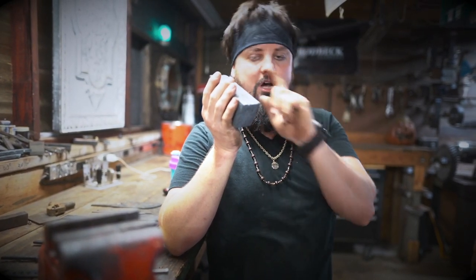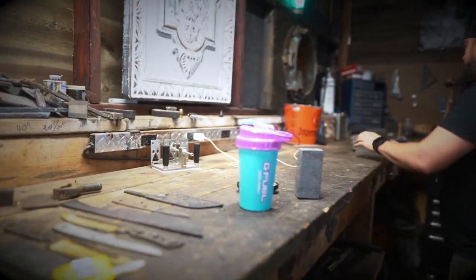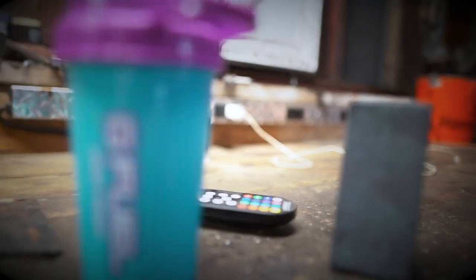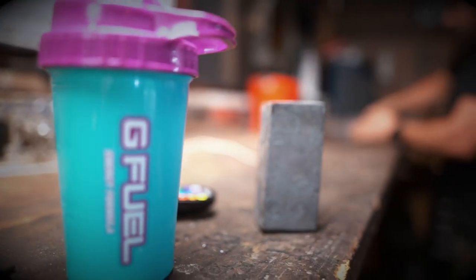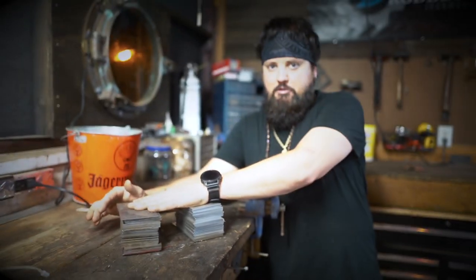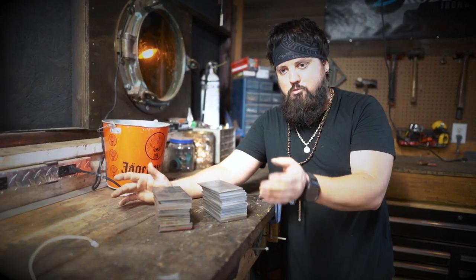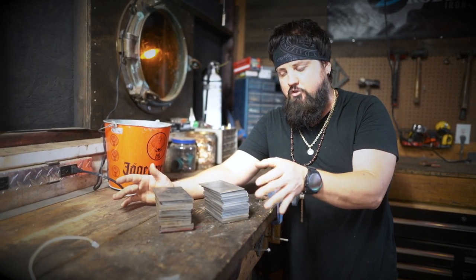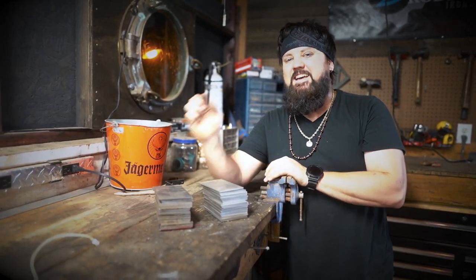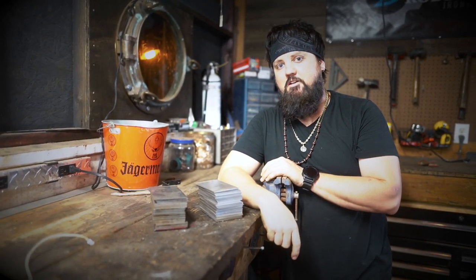I'll show you some clips of how I forged this twist Damascus out. I've got it set aside — once we get to the point where we need to make the butt cap and the top of the axe I'll come back to this piece of twist. For now, we're starting with all this 1084 and 15N20 cut up right here. We're going to alternate the stacks to start this axe build. I'll have to make two billets because it's already going to be huge, and then after forging, surface grinding, and restacking, I'll integrate different sizes of 1084 and 15N20 to give some really cool contrast. That's the plan — let's go check out this twist footage.